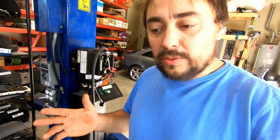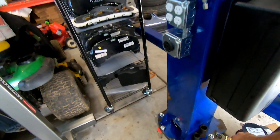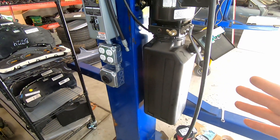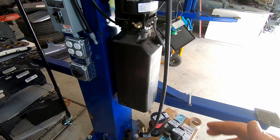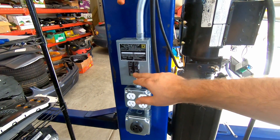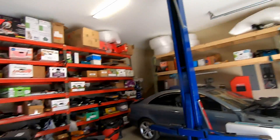It's day 56 probably of lift installation, though I was actually doing the electrical work for only a couple of days. This is how the final project looks — I haven't covered it yet so I can show you how it works. I decided to connect the lift to 240 volts with this NEMA 6-50 outlet. I figured there's no chance I'd use the lift and the welder at the very same time, so I can use this outlet for the lift as well. The 120 goes through these 15-amp breakers — one breaker for each side — and then it goes all the way to the panel in the box.